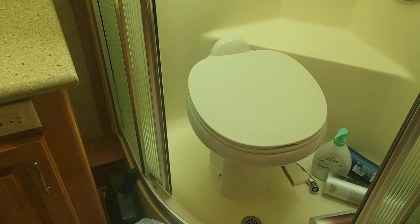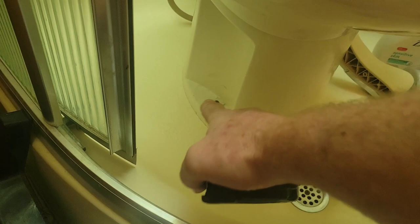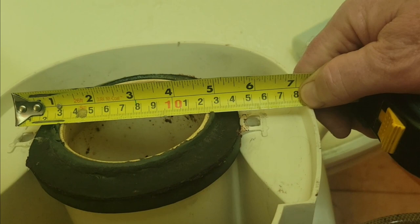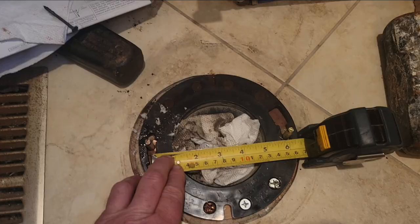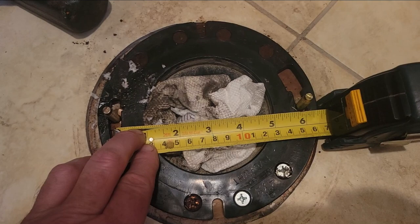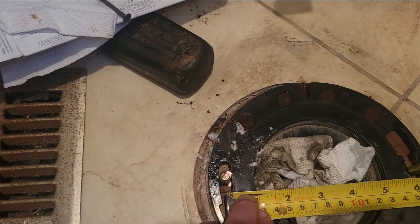The toilet base is sitting in my shower, so I'm going to measure the distance from this hole to the other one over there. I'll get my tape measure and measure that distance so I hit the right spacing. To my eye it looks like about 15 centimeters or five and seven-eighths inches center to center. The existing glued side is already centered, so I'll drill a hole straight across on the broken side at that same distance and go from there.